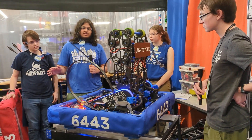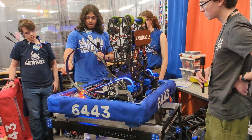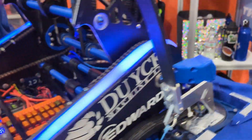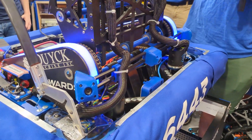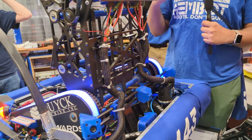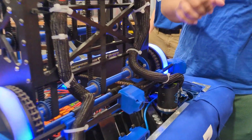Our auto sequences are powered by odometry, which is great but drifts over time, so we have three cameras on the bot — one in the front and two AprilTag cameras in the back that constantly use AprilTags to update our pose. All of this combined keeps our autonomous really on track and as consistent as possible.